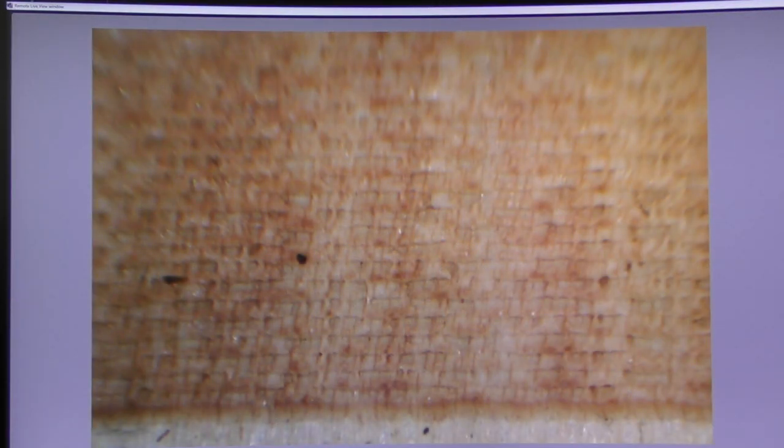Let's jump straight down to 100 millimeters a second, and we've put the power up now to 30%. What's going on there? So now we've definitely got the scan lines that you can see, and we're doing damage with the scan lines in a rather strange pattern, which at the moment I'm not going to even talk about. But what we're getting is, again, variation here because of different burning properties of different parts of the material. Some parts of the material are producing this, well, it's not carbon, it's not scorching. If you look very closely, you see that it's got little bright white lights on it.